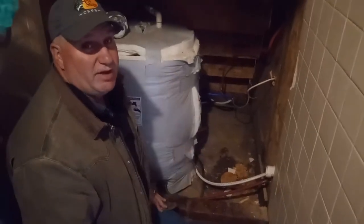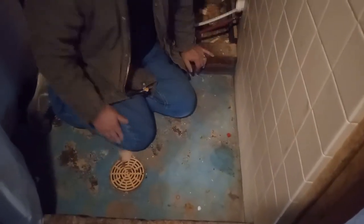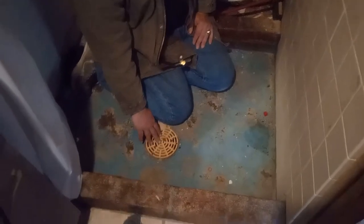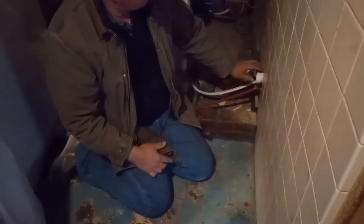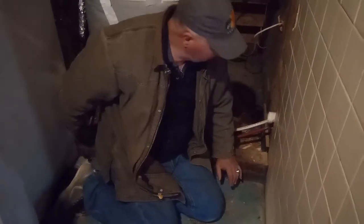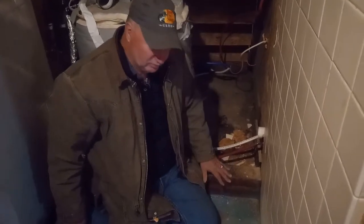But this is the journey you're going to see — us trying to lift that 200-and-something, maybe 250-pound tub and put it in here. Another thing to consider: the guys working with me said, hey, why don't we just run right into that? The problem is if this ever gets clogged up, I can't get to it with that tub sitting on top of it. So it'll come across here with room to reach in and connect everything up. This is the drain for the washer, and then I'm going to go across over the top of the beam, and in that transition I'll end up putting a trap.